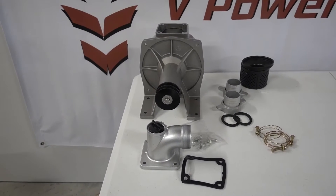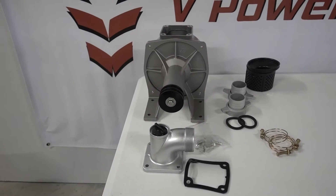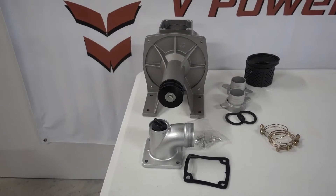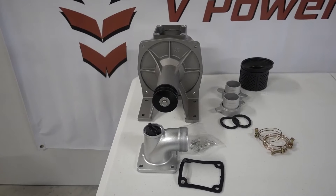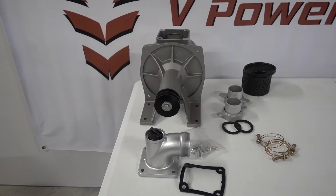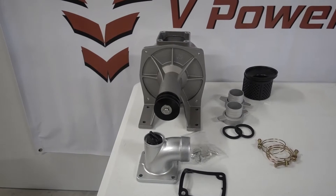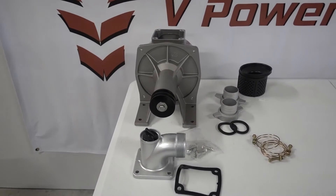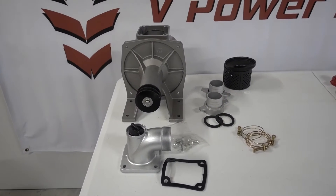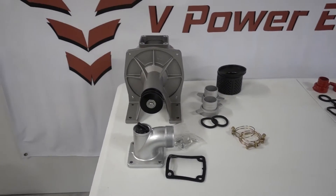This pump will pump somewhere around 7,800 gallons per hour with free flow. It has a 22-foot suction capability — it can pull water; it has to be primed the first time, and then as long as you don't drain it, it's self-priming after that. It can push water around 118 feet high. There isn't a whole lot to talk about with this pump because it comes pretty much all ready to go — just put the outlet on and power it up.